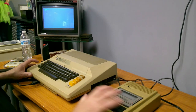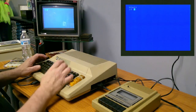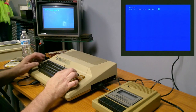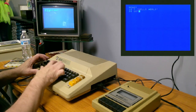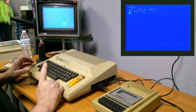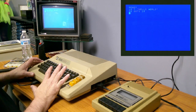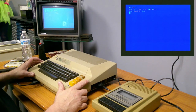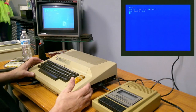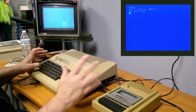And I'm going to save a program to BASIC. So I started up in BASIC. I'm just gonna do a quick hello world. All right, and now the way I'm gonna save it. Now, I know you can just use save and load. But when I used the 800 or the 600XL, it had the buggy version B BASIC in it. So you had to use list and enter because save added extra data to your program and you destroyed it. So I'm going to use the same concept I did then.